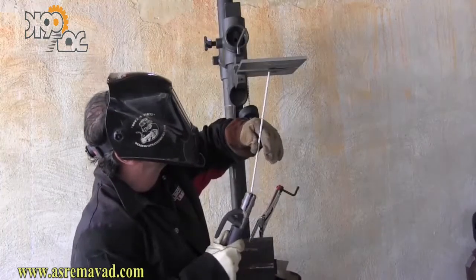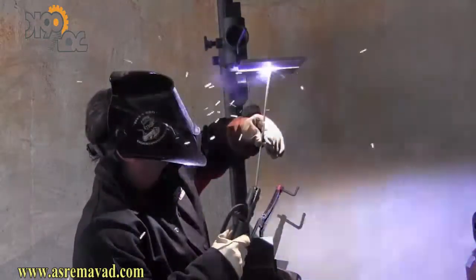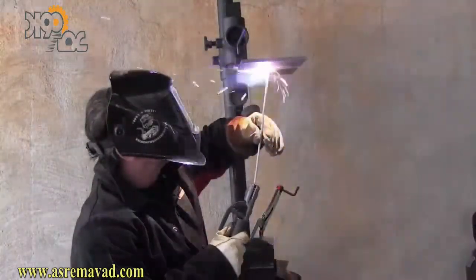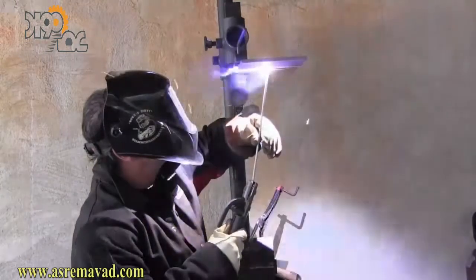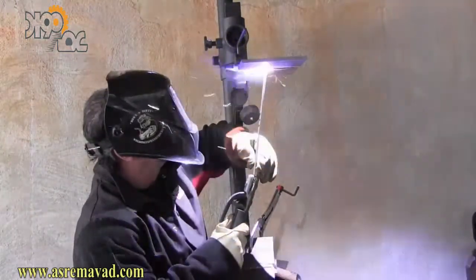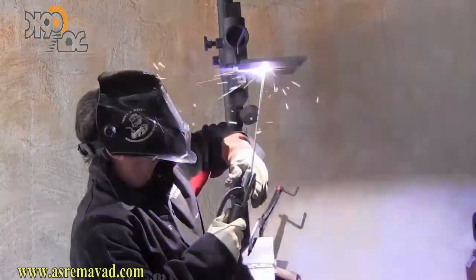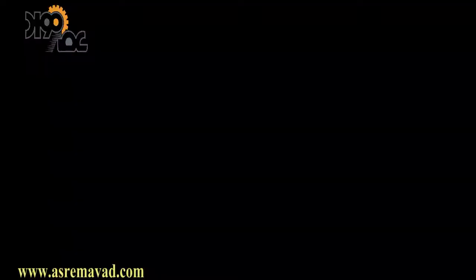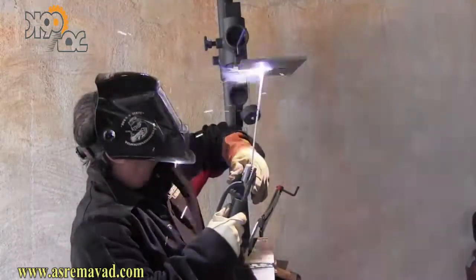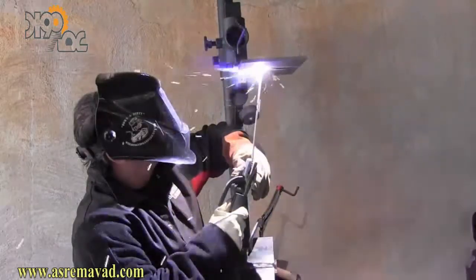You can also stabilize your rod with your second hand like this. For restarts, what I do is get it started, and then gradually as things start going well I'll gradually move my hand down and completely release it so I can feed the rod freely — because that rod gets hot, and if you've got a glove on that hand and you're holding it the whole time it can get annoying.